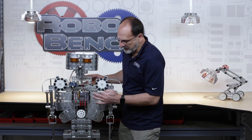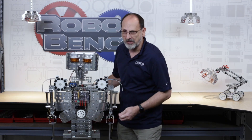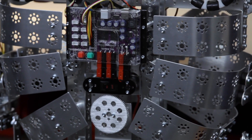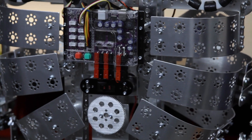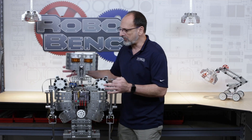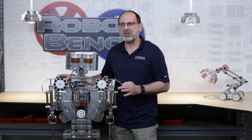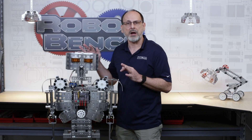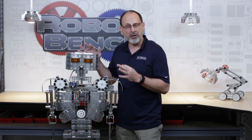Once you've gone through that, make sure all screws are tight — don't over-tighten, but make them secure. You don't want things falling off as you operate him. On final assembly, do a general overlook and tighten everything down. Once all of that is in place, we're ready to do final servo adjustments. But before that, we have to pair Mr. Robot — power him on and pair him with our controller.